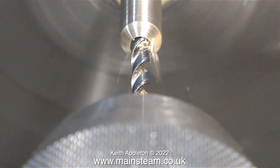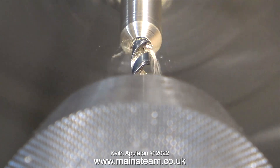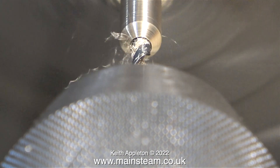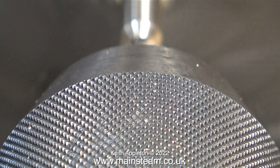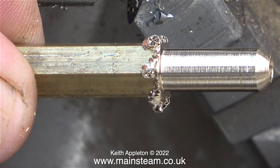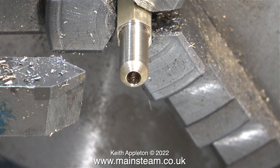The next part of the job involved using a centre drill to make a hole in the centre of the piece of bar, followed by a one-eighth of an inch diameter twist drill, and with this twist drill I drilled all the way through. The finished part looked a bit rough but this is just an illusion - you can remove all this mess just with your fingers, although I don't recommend doing that. I just rubbed the piece of hexagon bar on a piece of wet-or-dry sandpaper, 400 grade to be exact, and all of the roughness was removed and now it looks quite good.